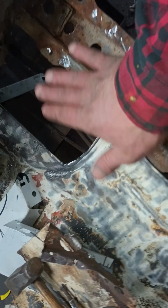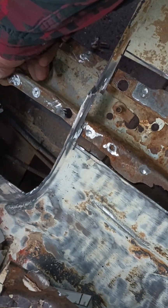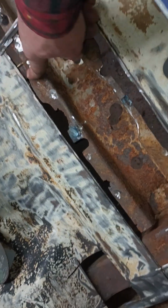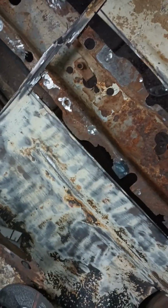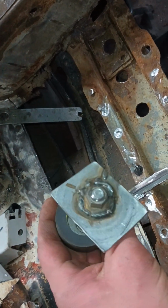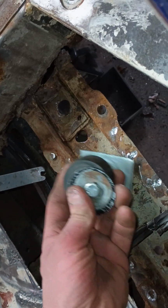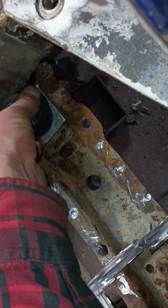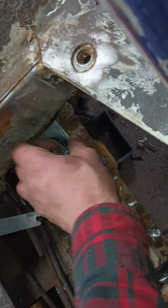floors. I got this part out this morning, starting work on grinding out these spot welds some. This support looks pretty good. I have the piece of metal. The body mount bolt that goes down in here, I made that too. Welded that up. I gotta chisel all that out of there. Then that can fit down inside there, and I'll weld it in place. And then of course the bolt comes in from the bottom. And I'm good to go.